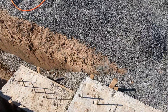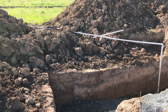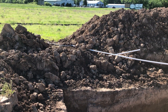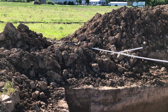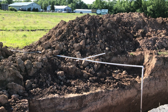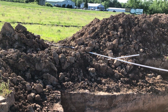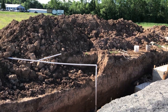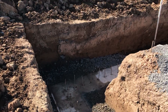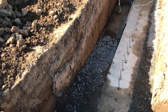You're probably wondering why these footers are so far down compared to the other one. There's going to be a walkout basement here, and the footers have to be four feet below grade. The ground is only going to be about where you see below that PVC over there. So we have to be four feet below because that's where the walkout basement is — that's why you have these step-downs, to get down four feet from about here.